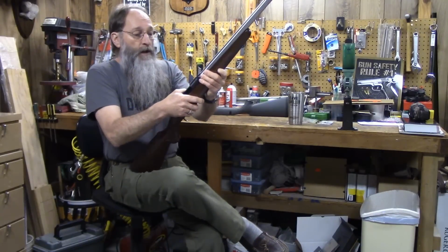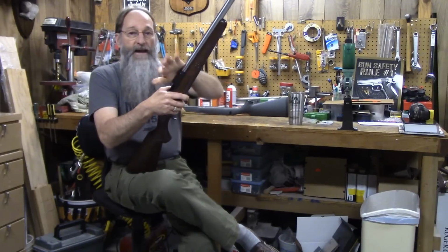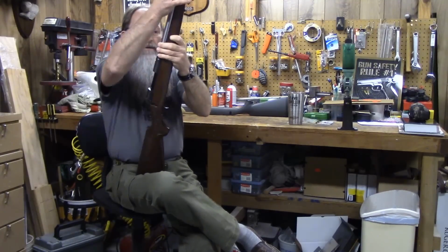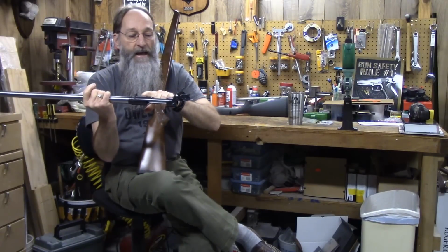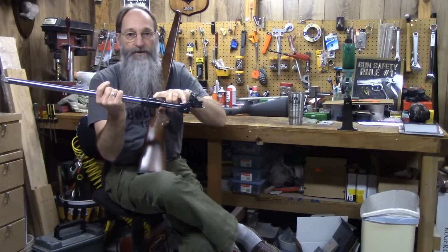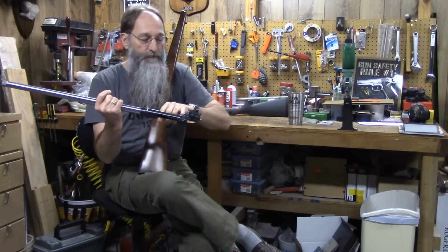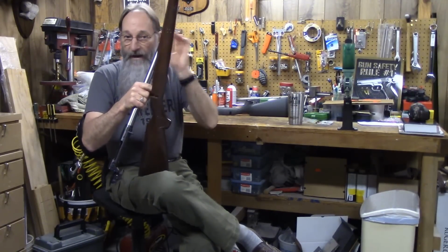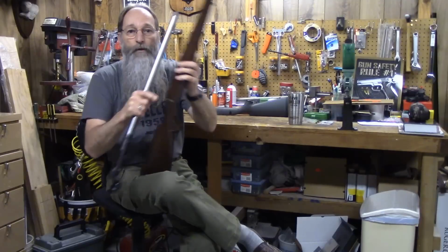What we're going to do, the third of the 3 Savages that I've been monkeying with. We're going to put this action barrel into this stock. If you remember the short action Savages, there's actually 4 different bolt spacings. It depends on the magazine that's in it, from the best I can read up on and find out. The action that was in this one, due to that bolt spacing, matched the Bell & Carlson. It dropped right in there. That's home for it nowadays.